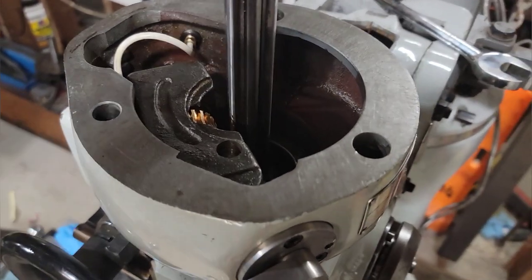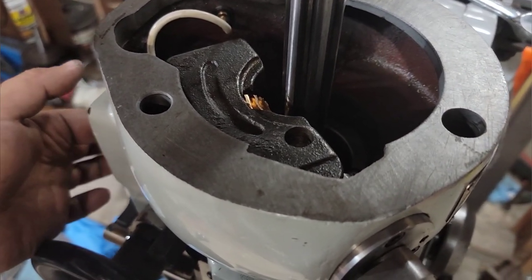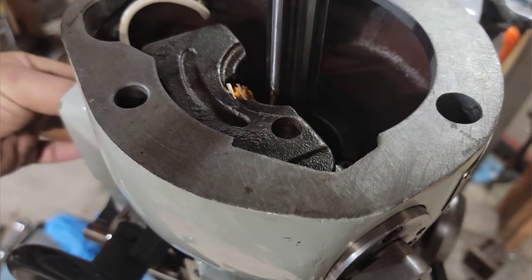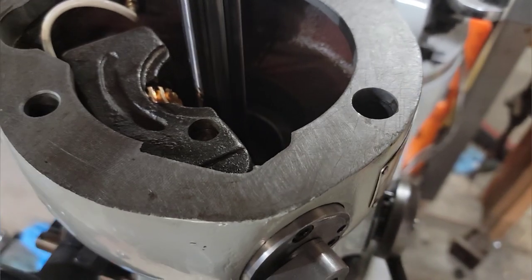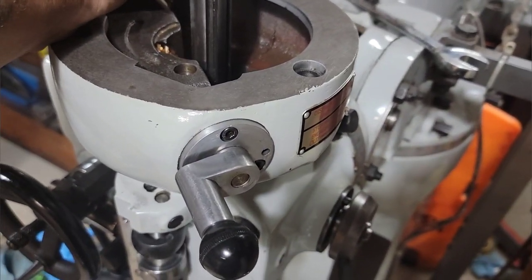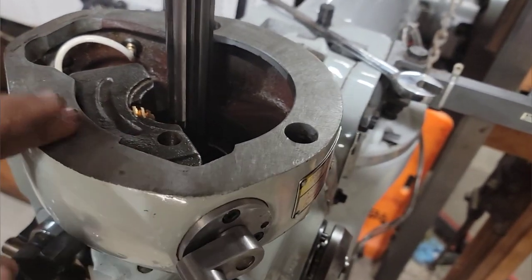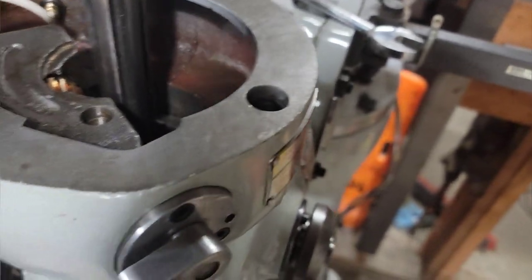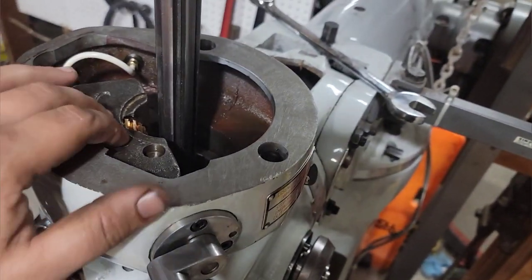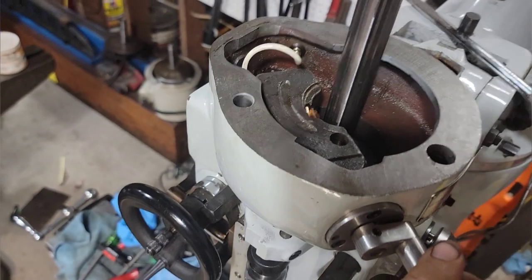Alright, the cradle assembly is installed. I found it actually beneficial to pick up your change gears - you actually have to - to get that shaft down in the pilot hole. After that it slid right in. As far as this bolt here: I did clean the threads out in the hole and on the bolt, and use some blue thread lock. There's vibration in these heads - or any machine really in general - there's enough to shake that loose. It's not a bolt that gets all the way tightened; it has to leave this range of movement. It just retains that from falling in or out.